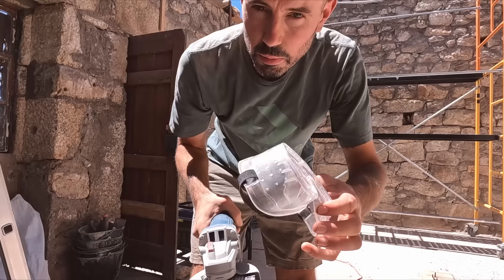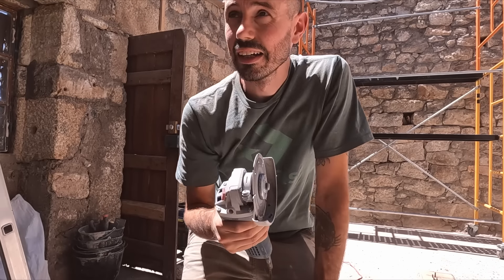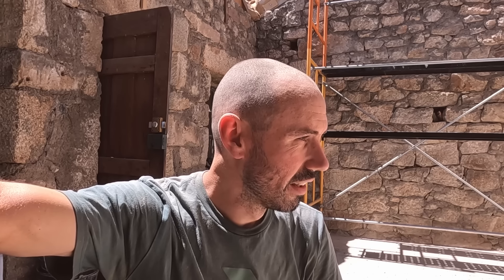I'm so covered in sand and dirt and filth. This process seems to be going quite well so far. I've done basically all of the back wall up to where the supports are for the ring beam form, because I don't want to disturb anywhere around there. The most difficult thing is that the concrete has been thrown all over — not just in the joints, but spread around them too. At certain points it's really hard to see where one stone ends and the next begins, and I've clipped a stone a couple of times, which I really don't want to do. So I'm being more cautious and unless I can guarantee the path of the mortar, I'm leaving it and coming back with a hammer and chisel.